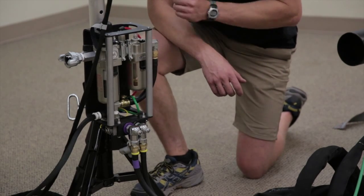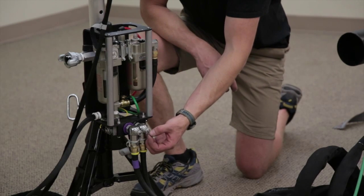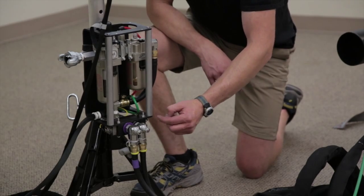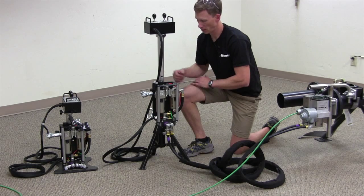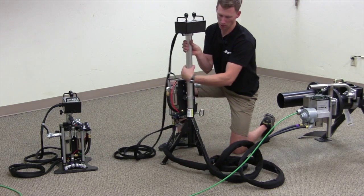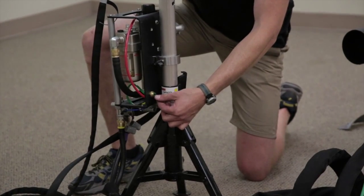The tool also includes two flow control valves so that the hose may be fed in and out at a desired speed. That speed is adjusted with a flathead screwdriver — screwing the screw in makes the hose feed slower. There's also a high pressure water dump which requires the user to connect a quarter inch tube to the back of the FRL.